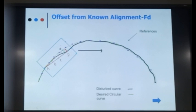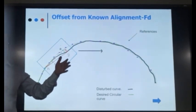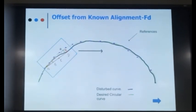With the help of the total station, suppose you know the center line coordinates of the desired track. Suppose initially during the construction stage, somebody has put the curve, and with the total station, first you have to fix a benchmark whose coordinates are known. With the help of that benchmark, you transfer it to the track, so you know the track center coordinates. And for the ideal track, if you know the center line coordinates in terms of northing, easting, and z value,